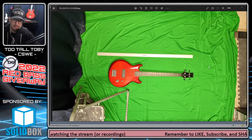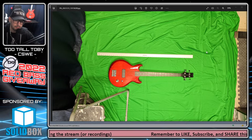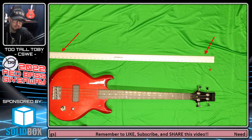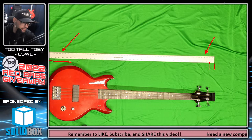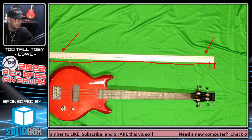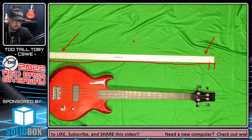We start out by trying to get one or several photographs. Another thing that you'll notice in this photograph is that I've got a ruler here. That's going to be very helpful when I go to drop this into a SolidWorks sketch. I'm going to be able to say, distance from here to here is whatever. In this case, it looks like it's 48 across that entire stick. So we can use that to help size our design, make sure that our photographs are within scale.